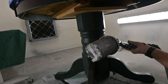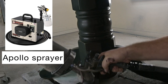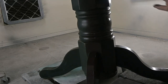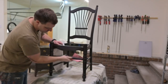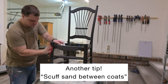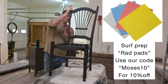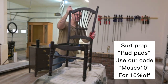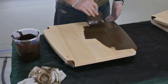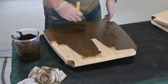In case you're wondering, we use an Apollo sprayer — the Precision 5 sprayer — and we like it a lot, we highly recommend it. One thing we do to ensure a factory-smooth finish is scuff sand between our coat of paint and our top coats. This gets all the air bubbles out, any dust or anything that has collected while the paint or stain was drying, and it gives such a smooth finish.